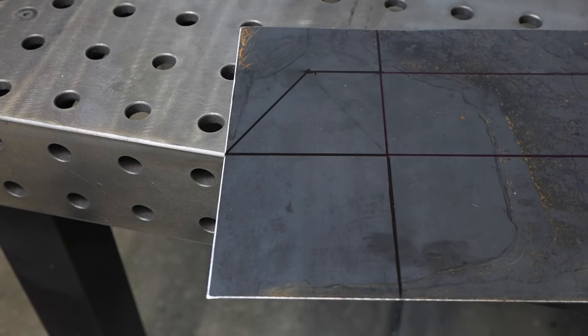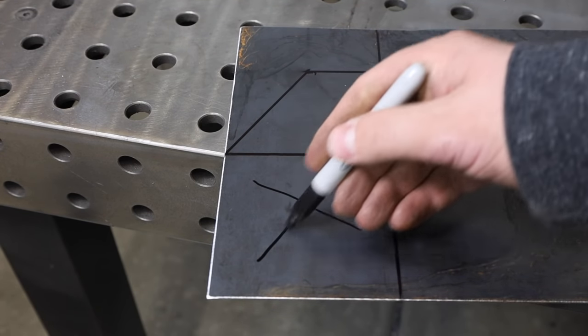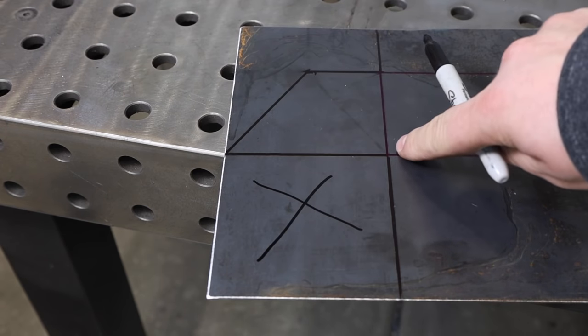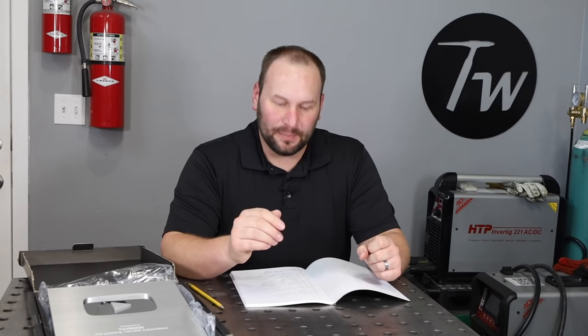On this pattern there are two bend lines that come together at a 90 degree angle at the bottom corner. Whenever you build anything like a pan, box, or tank, you're going to have that situation. If you just leave the sheet metal there it will actually bulge out on the corners and you won't be able to get a good tight fit. You need what's called relief at the corners to be able to bend that up. The easiest way to do that when cutting by hand is to drill a hole right there at the corner.